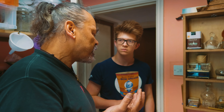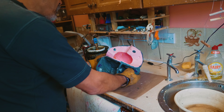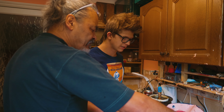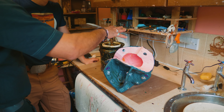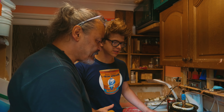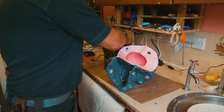This is out of the oven now — it's nice and warm. It's about 50 to 70 degrees, something like that. It's just so that when you put the hot wax in, it doesn't immediately chill. You want it to be able to flow into all the details. The first coat is probably the most important one. So what we're going to do is literally just pour that out.